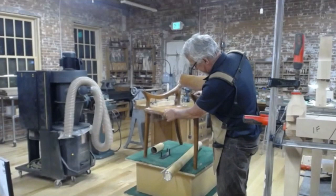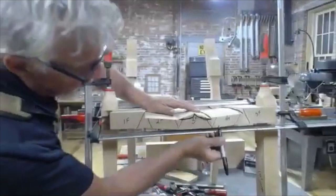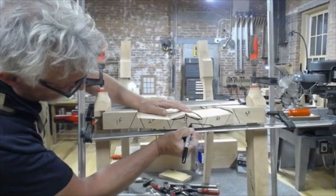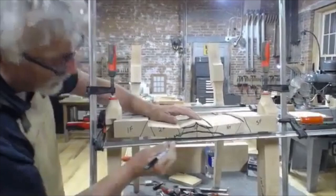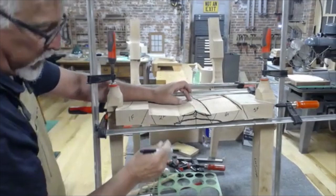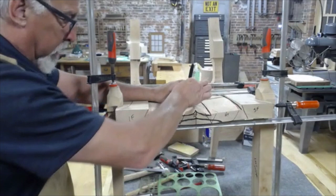And what I do is I go about, let's say, 3 inches and 3 inches, and on the underside, I grind like this. I'm over-exaggerating, and this is actually a straight line here. And then that grind goes all the way back 6-7 inches or so, but it's a triangle. On the underside, it looks like this. Are you following that? Okay.